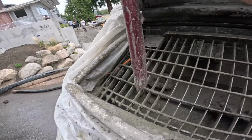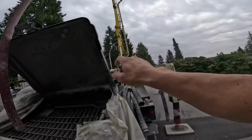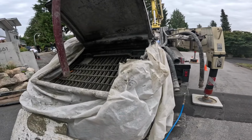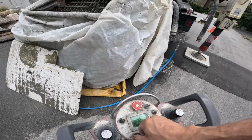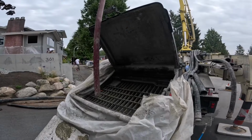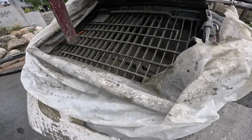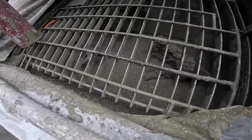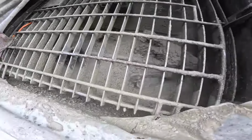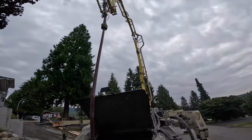So we're good there. We'll take a couple strokes in reverse, just so that stuff that's in the main section, we can pull that right back into the deck pipe. So nothing crazy. Turn my auto RPM control off. It's a bit of a pain in the butt come cleanup time with all the fluctuations. That mud coming back up a little bit. We got the air. That's about as much as you want to pull now. I'll swing over, buck the hose off, pull the sponges back.